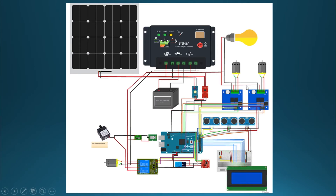This is the schematic — the circuit diagram of the whole project. As you can see, one motor is used for forward movement and the other for the brush; both use the motor driver. The third motor for horizontal movement uses the relay module, and the second relay controls the water pump. The three ultrasonic sensors, current sensor, voltage sensor, RTC module, and temperature/humidity sensor via the DHT11 are all shown. A buck converter takes 12 to 24 volts from the load and converts it down to 5 volts to power the controller and peripherals.